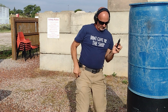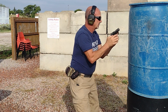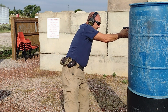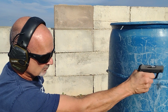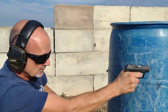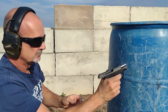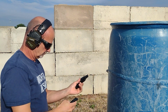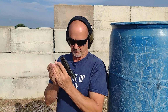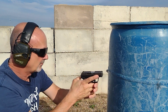But as for recommending it, well, if you don't mind installing the Galloway Precision Spring Kit, a stiffer mag button spring, and maybe a stiffer recoil spring, you can end up with a pretty sweet pistol, basically adding about $150 when you factor in installation to the cost of the pistol. I expended over 2,000 rounds troubleshooting and experimenting to get the 22 LCP right. If you get one, hopefully this video is your shortcut to a reliable 22LR Ruger LCP II.